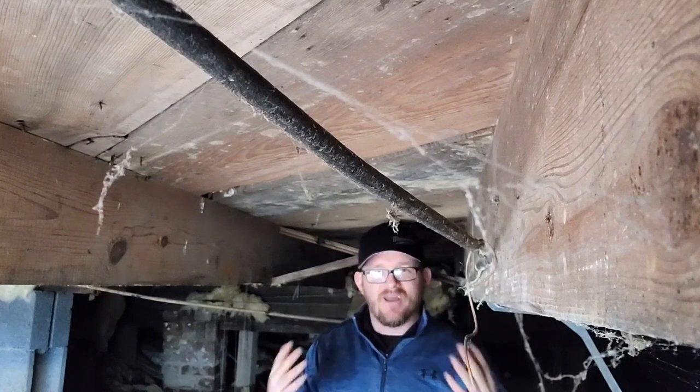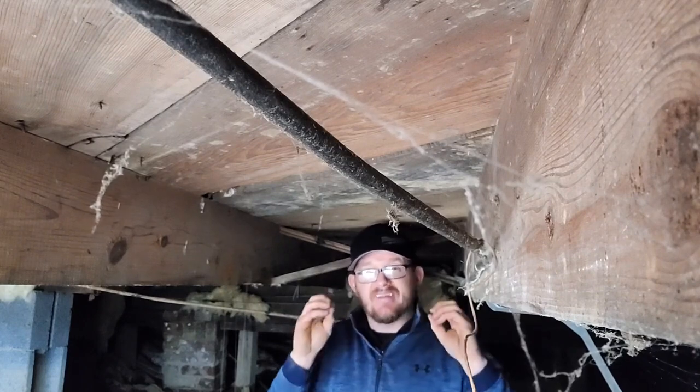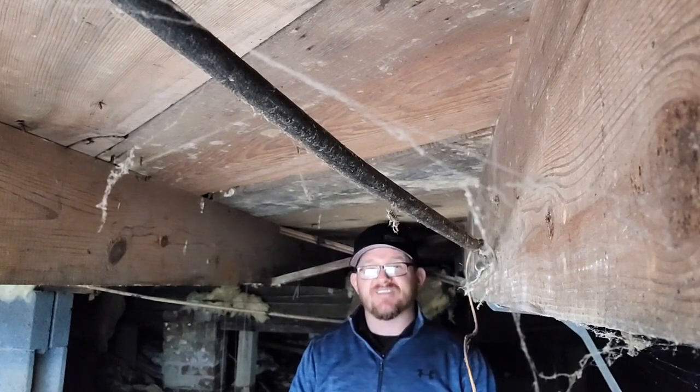There's one more thing I wanted to show you, and I'm glad you stuck around to the end of the video. This is something I've never seen — it's actually a knob and tube keyless fixture. If you notice on the left-hand side, they are tapping the hot; on the right-hand side, they're tapping the neutral, or vice versa. That is actually a light socket. If you want to talk about the definition of dangerous inside of a crawlspace — it's completely open. The terminal lugs are on the outside, completely open and just waiting for us to back into it. So we have to be super careful. I hope you guys have a blessed day — let's get to it.